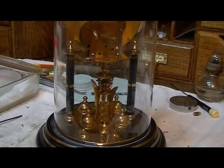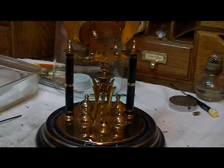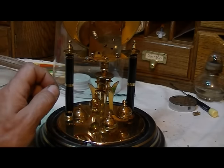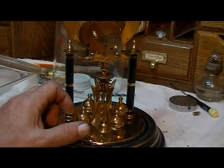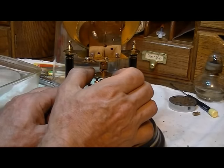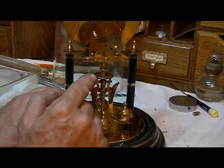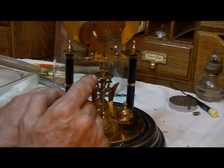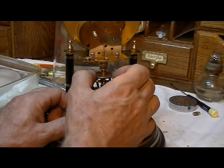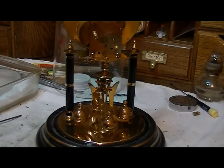Wait 24 hours. Let's say it's been another day and you find out the clock is running about a minute fast — we went a little bit too far. Here's what you do: stop the pendulum, and we're going to go counter-clockwise. Your mark is here. Go counter-clockwise a little more than a quarter turn, and come back just a few degrees past where it was before. Let go of your pendulum, let it start ticking again, and wait 24 hours.